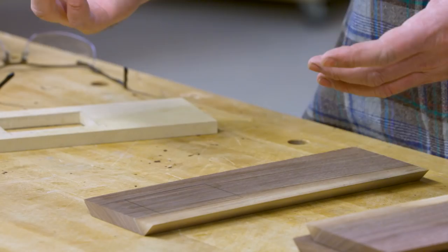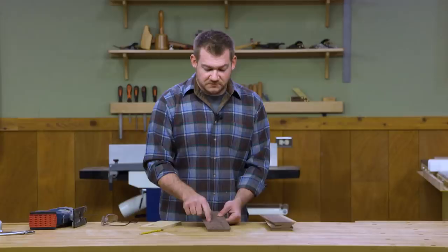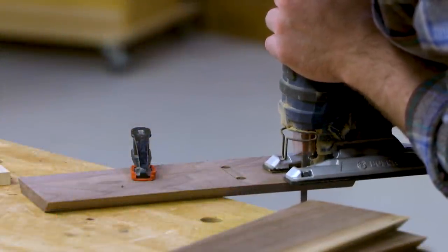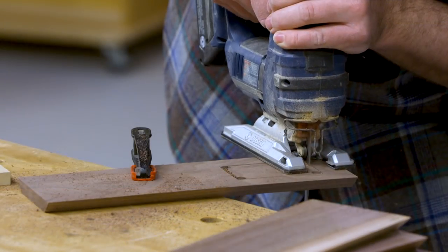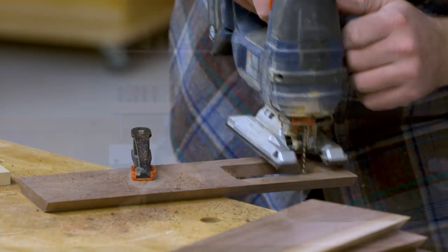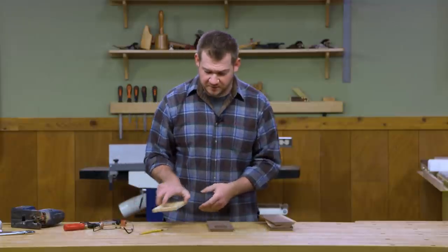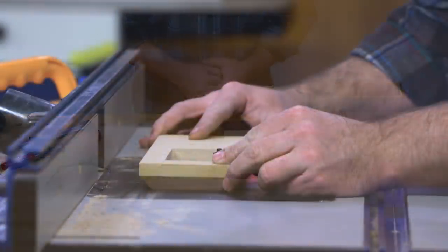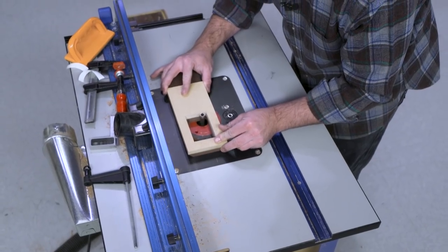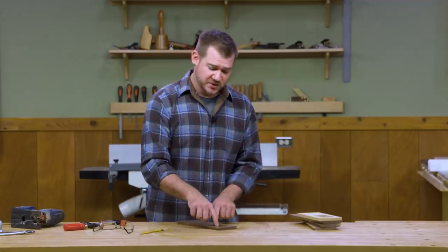Once that's laid out, a quick trip to the drill press will leave us with four corners drilled out. Once the holes are drilled, we cut the waste out with a jigsaw. With a sharp blade, you can make quick work of cutting those windows out, but there is a little bit of cleanup to square everything up. That's where we use the template again — stick it down with double-sided tape and use a flush trim bit in the router table to trim everything square. That leaves us with a nicely cut, smooth window, with just a little chisel work needed to clean up the corners.